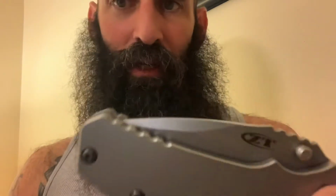So being self-critical, that's something I can improve on. Like how I fixtured it, I had bolts holding the scale down while I was chamfer milling it, and it was coming really close to those bolts. I probably could have cut into the bolts or relieved them a little bit and got the chamfer size I needed. But this was a project I did at work at a machine shop with an open spindle, when I had the moments to do it. So you're not trying to spend an exorbitant amount of extra time.